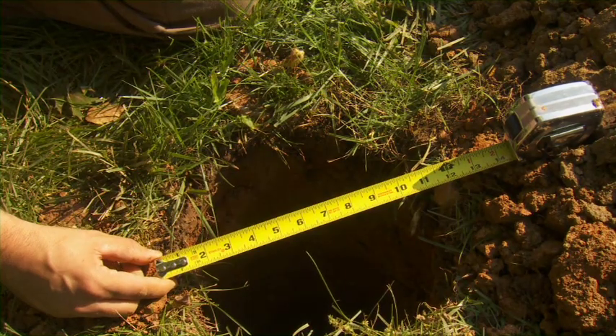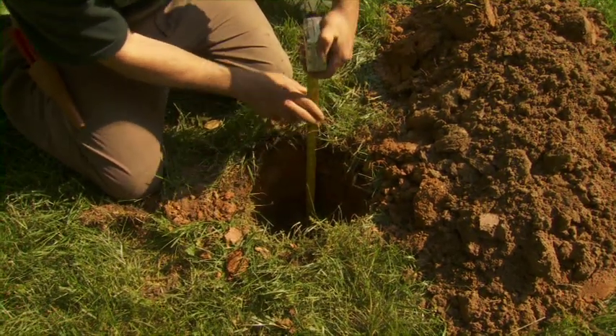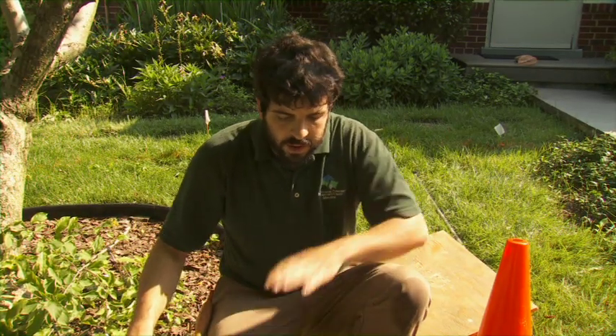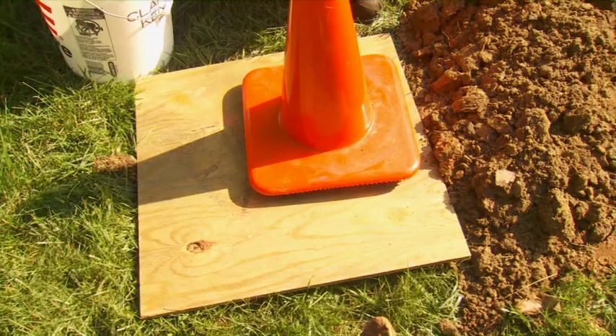You can see we have our 12 inches for our width and 2 feet for our depth. We want to fill this hole up all the way with water and time how long it takes to drain down. We record that first time, then fill it again. It's that second drawdown that's really important, because dry soil pulls water sideways. We want the soil to be saturated to determine our perk rate. After filling, we cover it for safety, put a cone on it, come back later to see how far it has drained, then fill it again and record that time to know if we have a suitable location.